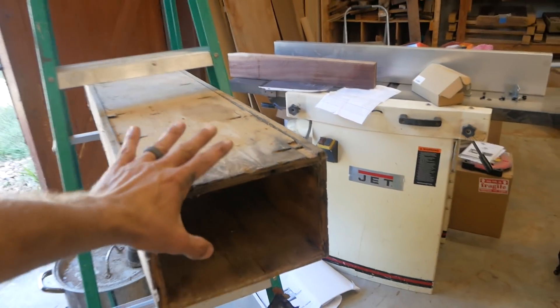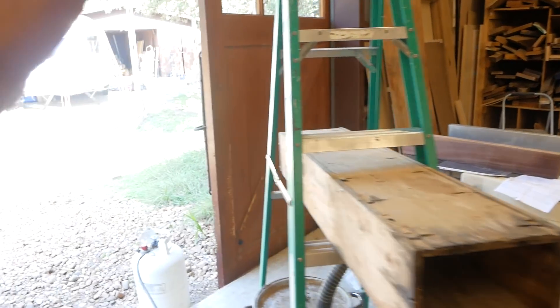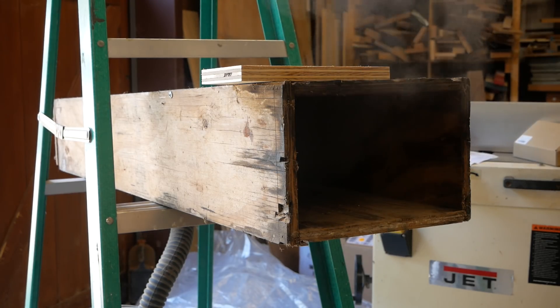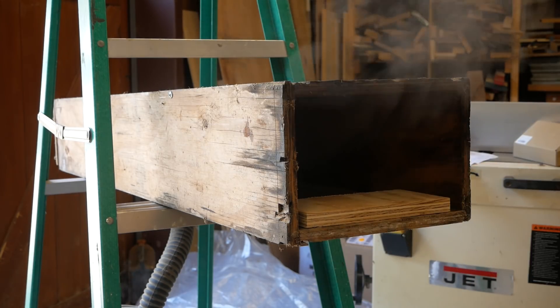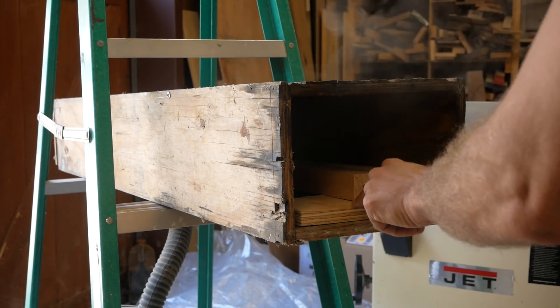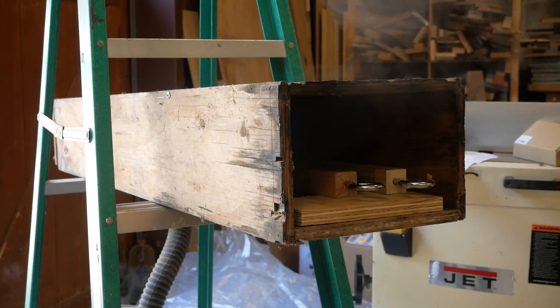Okay, steaming setup. This is my old steam box — built it around 2006, not in great shape but it'll work. Turkey fryer boiler, a pot with water, radiator hose to the steam box, propane courtesy of the Argosy. The rule of thumb with steaming is you steam for one hour per inch of thickness. Our parts are about an inch and three-eighths, so we'll steam for about an hour and a half. The smell of a steamer just gives me flashbacks of my apprenticeship — I actually really like it.